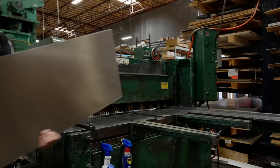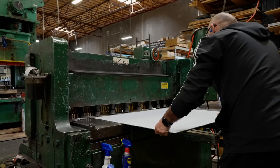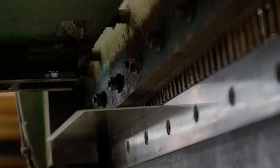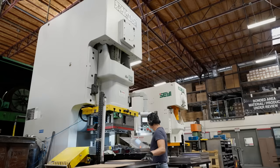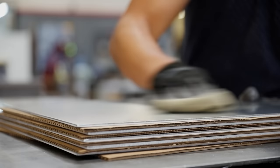What you're seeing in the case of Tyr is the entire process. First, they take large sheets of metal — four-by-eight sheets of aluminum in this case. They shear it to size to about a 16-inch blank for Tyr. After the shearing is done, they go over to a punch press — a 200-ton machine that basically punches all the holes, all the figures, everything that's important to the chassis in one shot.